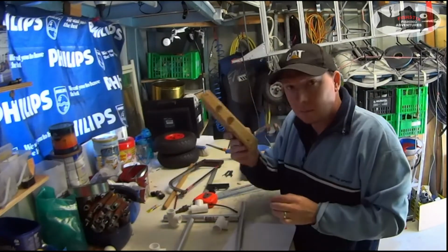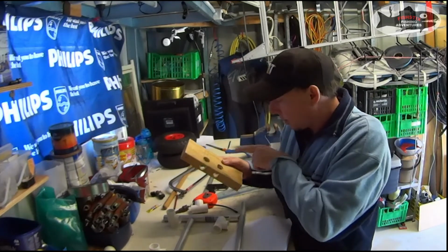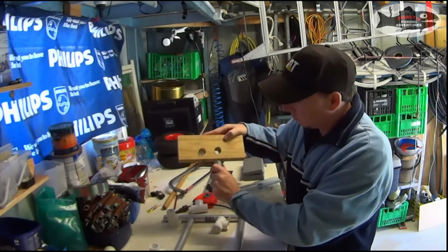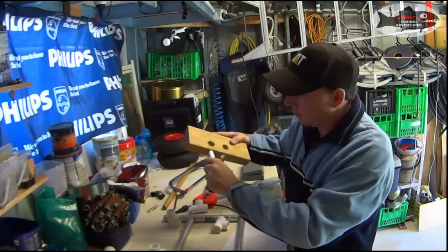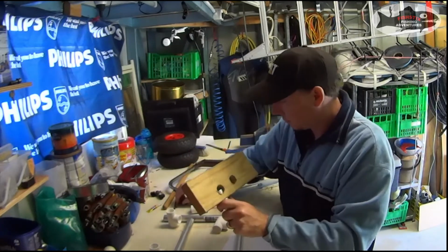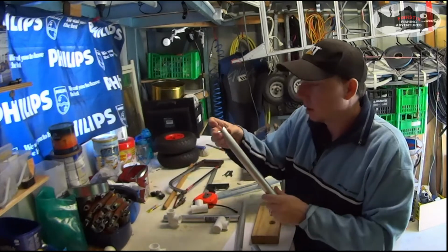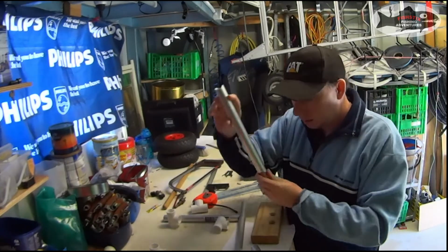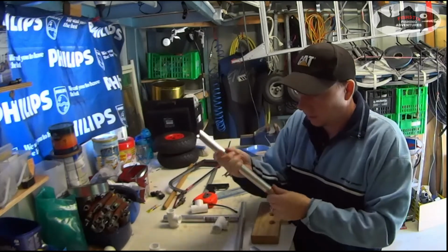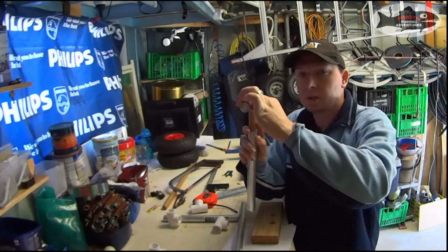I've used this bit of a jig, so pretty much 25mm hole saw, 25mm hole saw this direction as well, so you can feed the pipe in. Feed the pipe in nicely there, run through with the hole saw, and you get yourself a nice little curved edge, like that. And that sits nicely on there. We've done the same thing with the 22mm bracing internally. That fits nicely across there as well.